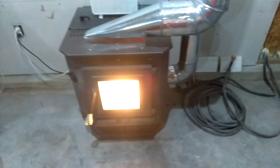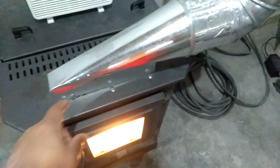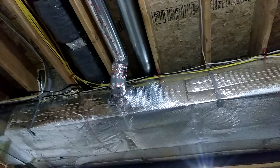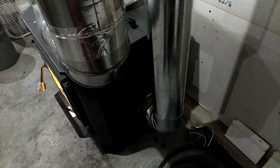Here's the little project I've been working on. This is a second pellet burner that we have, and I converted this thing over. I cut a hole in the top right here, put a duct on there, and ducted it up. It goes all the way across to over there. That duct right there is the cold air return — I'm coming out of the cold air return, circling around and coming all the way back down. So you're not pulling any air out of this garage — everything is coming from the living area.